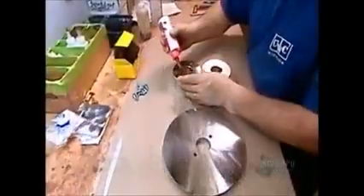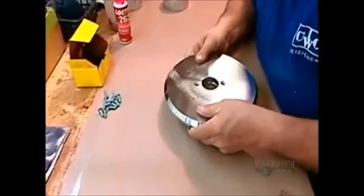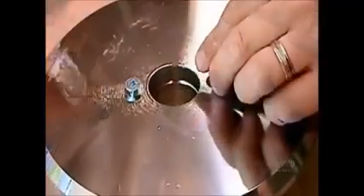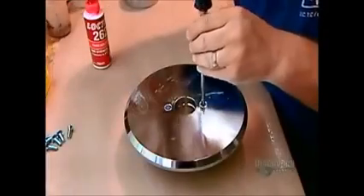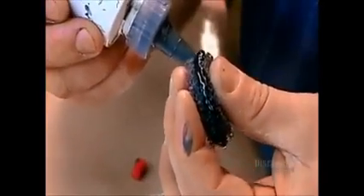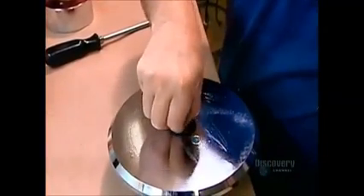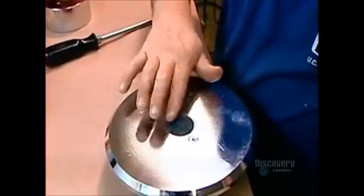A reamer bores a large hole through it. They apply super high strength epoxy glue to the core and to the back plate, the plate with the smaller hole. They glue and screw the pieces together because the bond has to be strong enough to withstand intense magnetic pull. They glue a foam filter in the hole to ensure the vibrating cone doesn't draw in dust and cause internal damage.